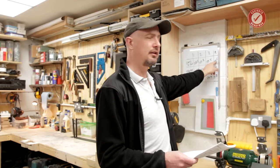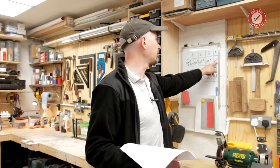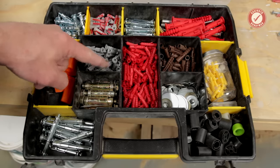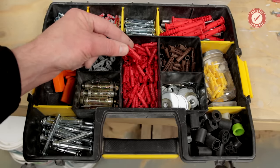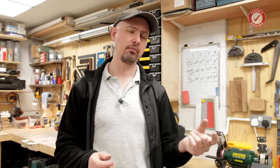It's nothing to worry about because it's holding such a huge weight anyway, and they tell you not to go beyond 97 kilos — which is significantly heavier than me. The fact that I'm getting an average of 140.5, admittedly without a safety factor, means just don't go past their figure of 97 kilos and you'll probably be absolutely fine. For me, the Duopower — now that I've been using it for a year and I'm confident it does the job — will replace the little GPF fixing in my fixings box, and it will replace my red plugs. There's no point in having red plugs when I can use the Duopower. Though with these fittings, red plugs, and brown plugs, you can do knock-through or push-through installations.